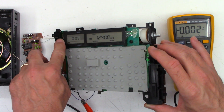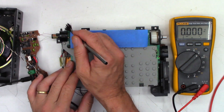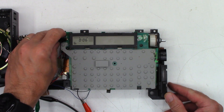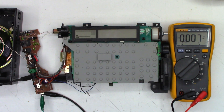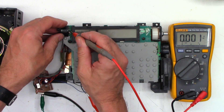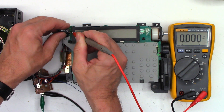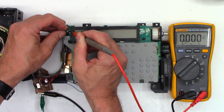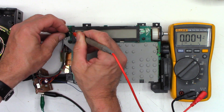When I had it tipped up, I noticed a little bit of gunk down here in the power switch. So the first thing I'm going to do is just try to clean in between the leads and see if it makes any difference. That certainly seemed to do it — power on, got audio, power off. Let's hook up the 3 volt power supply, turn the main power on, and measure that pin. I see 0.00 with power on 3.026. Power off, power on, timer — it's working perfect. Just some crud on the circuit board, conductive no less.